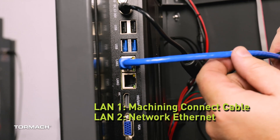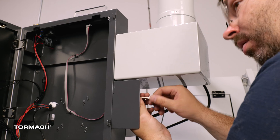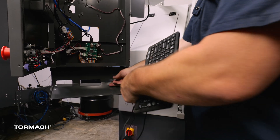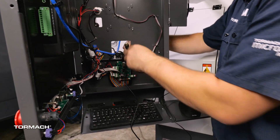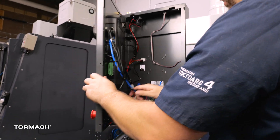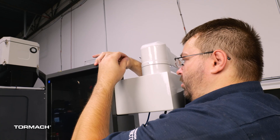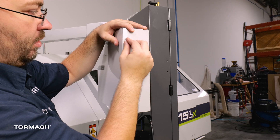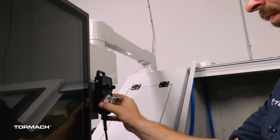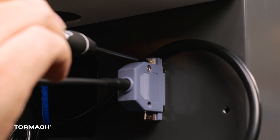The machine ethernet cable is attached to the LAN 1 input. LAN 2 is reserved for a wired internet connection. Install the mouse tray and the pendant tray to the right side with the provided screws. Place the mouse and keyboard on their trays and route the cables to the back and through the rear hole of the console. Insert both USB cables into the available slots on the controller. Then arrange the cables neatly and close the console door. Re-secure it with the screws removed earlier. Re-install the rear arm panel and re-secure it with the previously removed screws. Insert the controller key on top. Place the pendant onto the side tray, drape the cable in back, attach it to the pendant connection, and secure it with a Phillips screwdriver.